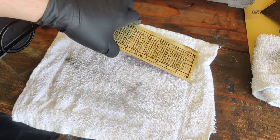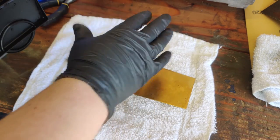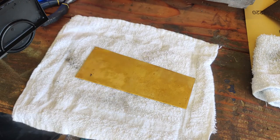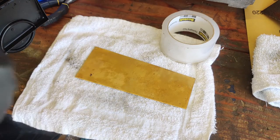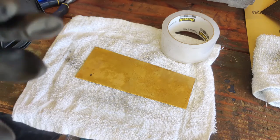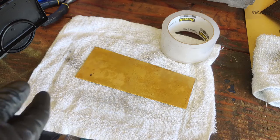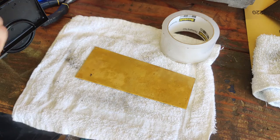Normally if you have a couple mistakes like this on one side, you can just take some nail polish and paint it on there to kind of cover up for those. But with a bunch of the spottiness over here, I think I'll redo this. Now we're going to go on to the etching. I've tried a few different ways of doing this, including using a bubbler to give you extra etching action. But in my experience, a lot of those can introduce more inconsistency into how the process goes. I haven't had really consistent results using a bubbler or agitator of sorts.